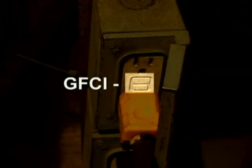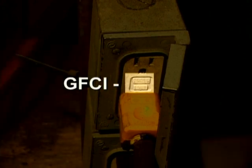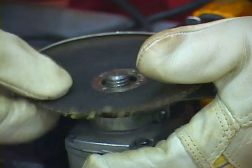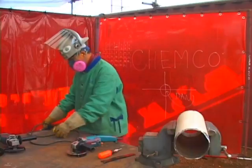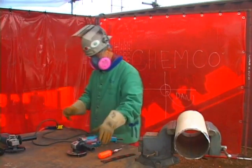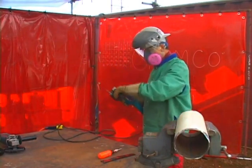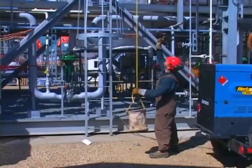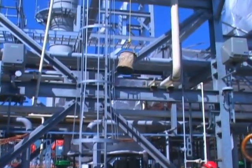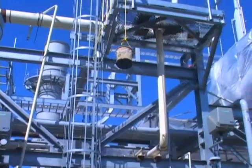When working with temporary power or in damp locations, use ground fault circuit interrupters to help reduce the potential for electrocution. Always replace the wheel or disc if the tool is dropped while grinding, and always be aware of the power cord as it can become an electrocution hazard if the grinder cuts into it. Use canvas nose bags to raise and lower grinders from elevations — do not use the electrical cord for lifting a grinder.